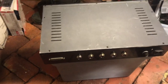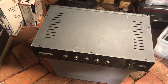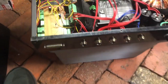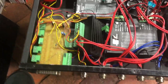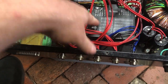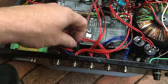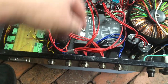This is the controller assembly for the CNC as I received it, which has a number of components inside it. We've got three stepper drives. The largest one I'm assuming will be for the Z, next one down for the Y, next one down for the X. In terms of power supply, looks like we've got fused power supplies to each of the drivers.